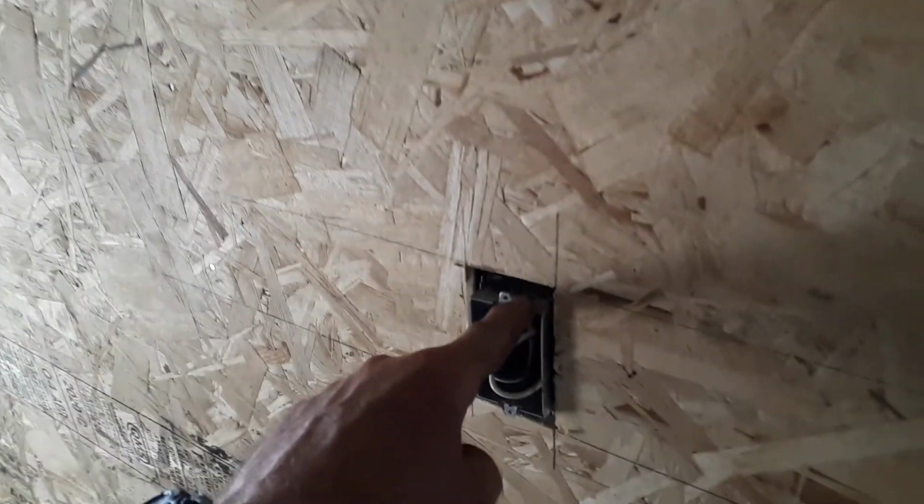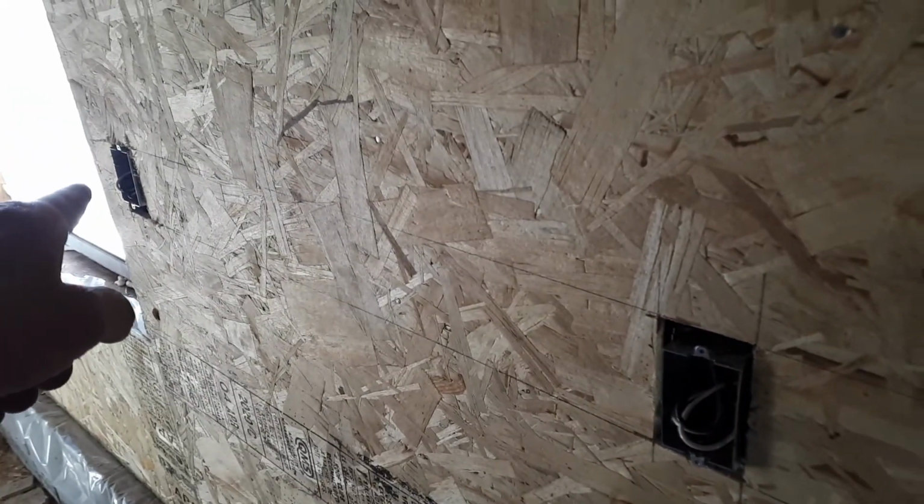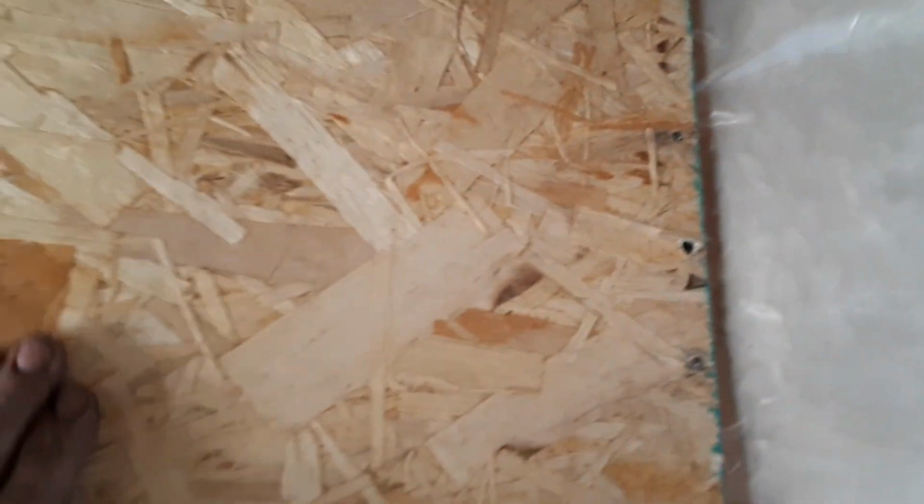So I got to cut these four plugs in that blue sheet. And you really can't make a mistake. So I'm going to do that tomorrow morning. I'm going to try and get this insulation tucked in there, get some vapor barrier down with the window, get that aspenite, I call it aspenite, OSB. It's 7/16